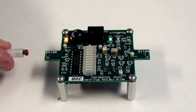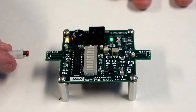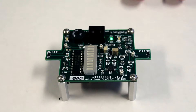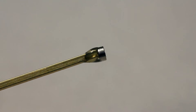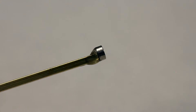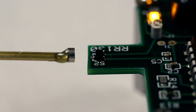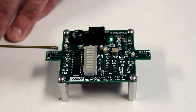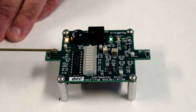I'm using a north pole here. This is what we call a unipolar sensor — it only responds to one particular pole of a magnet. That's not to say it won't work with a south pole as well. Here's a magnet mounted with its north pole facing out; as I bring that in, the sensor turns on. But I can get exactly the same effect by moving the south pole of the magnet towards the other side of the sensor.